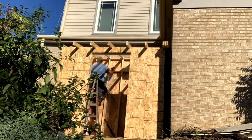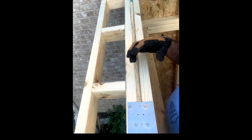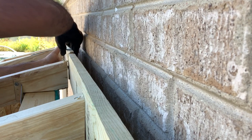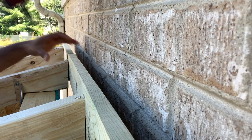In addition to screwing in the rafters to the walls, I also used hurricane ties for some extra strength. Overhangs were added to both ends of the shed using screws and galvanized tie plates for extra strength. 1x4 pressure treated boards were used for the trim, and I added these to the rafters all around the shed before putting on the roof OSB sheets.